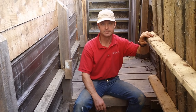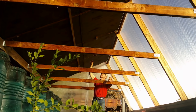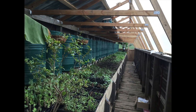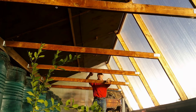The roof is important because especially in the winter you can lose a lot of heat out of it. There are insulating panels back here — one permanently affixed, and one up here that actually comes out. You turn these little wooden pegs and drop those out in the summer because that's where the sun comes in in summer — I have a 76.6 degree azimuth in the sky. But in the winter, the sun is way too low. From around October all the way to March, the sun is too low to come in through the top, so I put these insulating panels in and block it off.